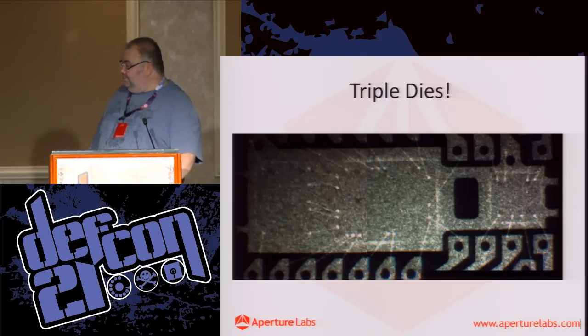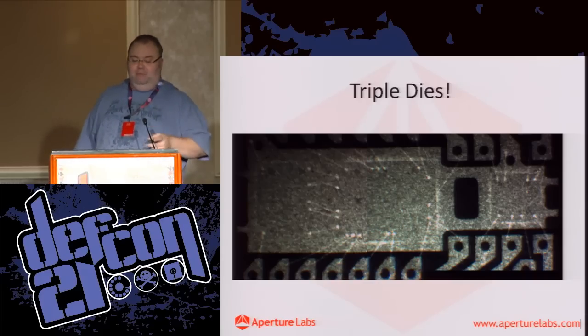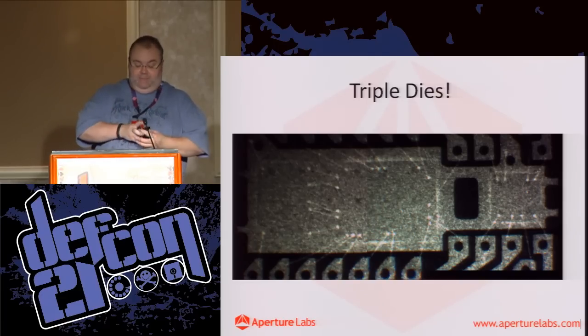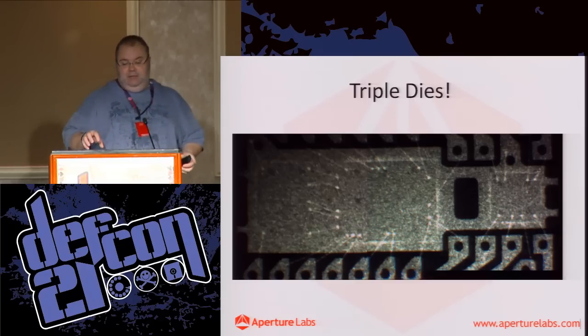And the way we actually figured out it was an RF chip was he pulled it out of the bottom of the jar when we plinked it and zoomed in. And there was the manufacturer's part number on it again. Just look it up. Holy crap. But the interesting thing was, I must have plinked half a dozen of these chips. I go through the debris and pick out the processor and the EEPROM. There are bond wires between them, so they're joined together, easy to spot, and you just pick them out.